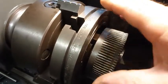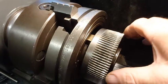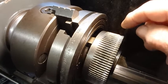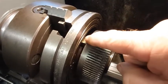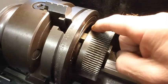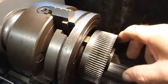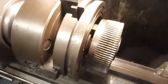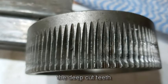It was at this point I suddenly realized that the actual cause of the trouble was that on one side of the worm wheel the teeth were shallow and on the other side they were deep. It had been cut eccentrically, out of true, and there was no way the worm could engage correctly with the worm wheel. What had happened is that the worm engaged on the deep part, and as I rotated it and found it a bit stiff, I just carried on. As it went into the shallow part it bound and stripped the teeth, and as it came around to the deeper part it was free again.